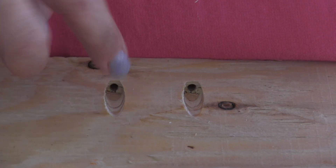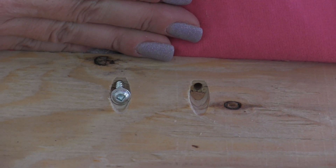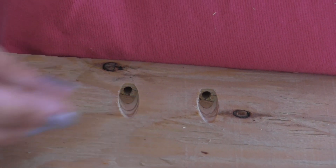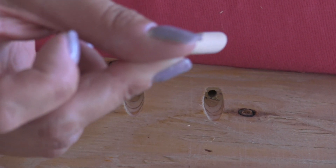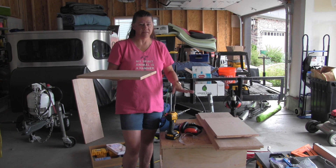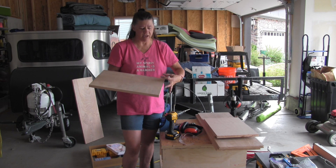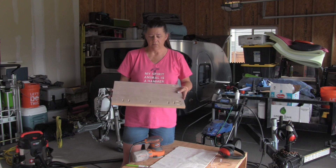This is the pocket hole we just drilled. You put the screw in, hold it up to the piece of wood you're joining, and screw it in — the screw hides all the way down in that hole. Then you cover the hole with a plug and once it's in place you won't see any seam at all. Now that we've done a test run and know our tools are set up correctly, I want pocket holes at each end of the shorter pieces and, on the longer runs, at each end and in the center.